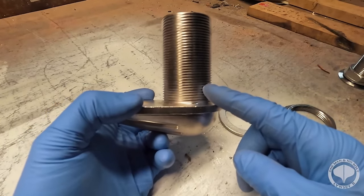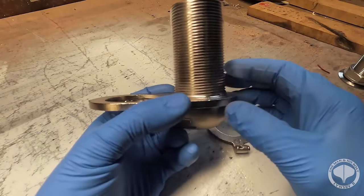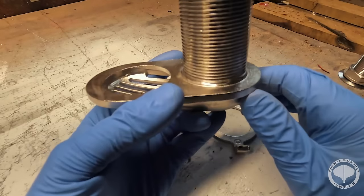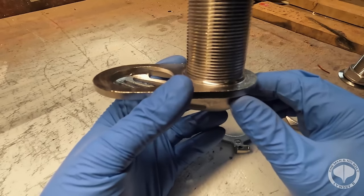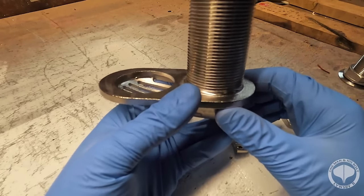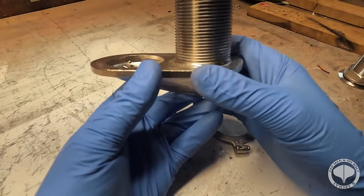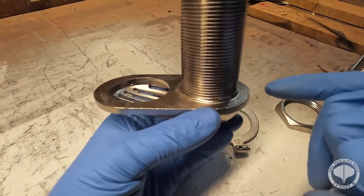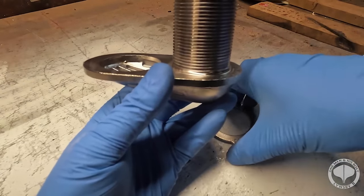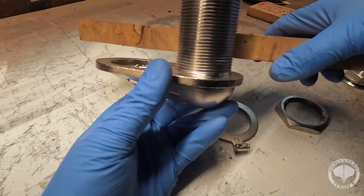It comes in three main parts: the scoop itself, then the earthing band, and then the lovely big nut. When you fit these, it's best to have a packing block at the back. You pick your place — hopefully the lowest part of the vessel — because you don't want pumps or sea cocks to dry out; you want them constantly full of water. Once drilled through, we put the scoop underneath the vessel. Put a bead of Sikaflex all the way around the lip, then fit the block on the inside.